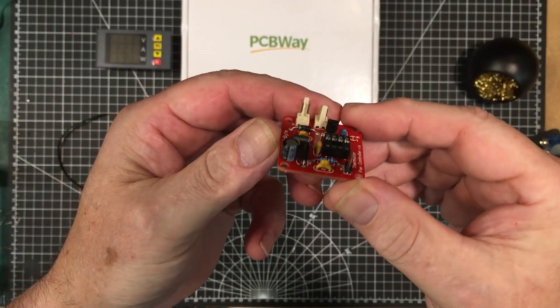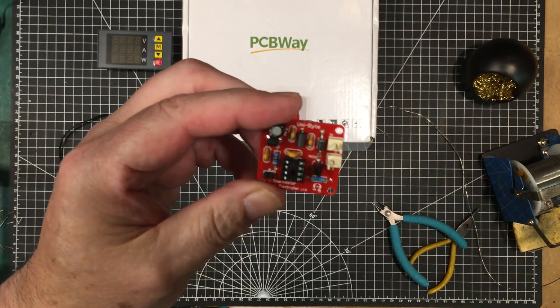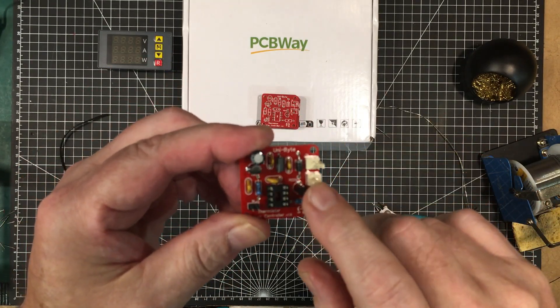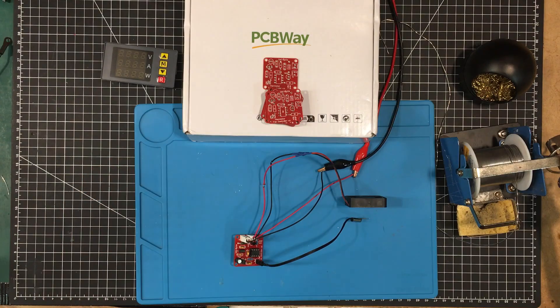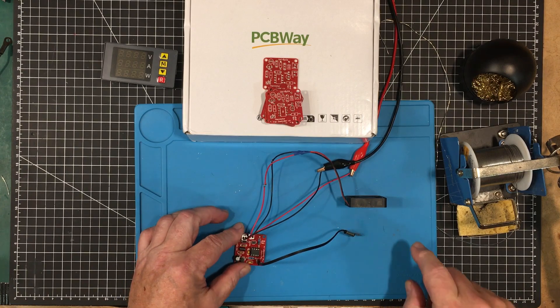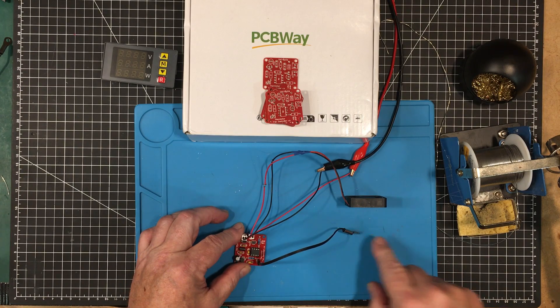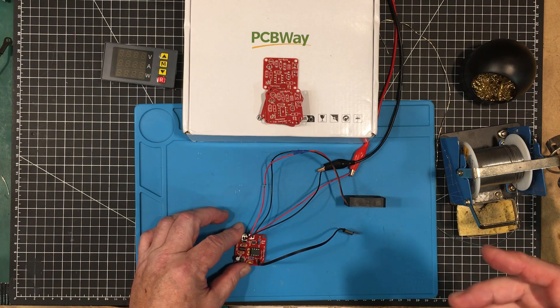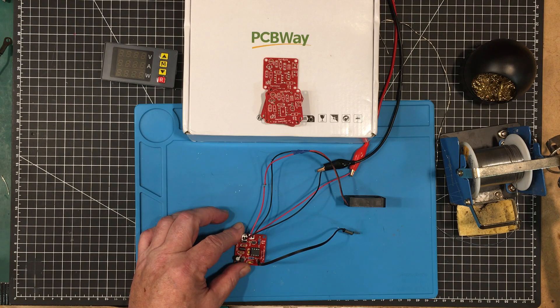The board is all soldered together. Just to test it out — we've got 24 volts, a fan, and a thermistor. Here's the little test setup: I'm going to heat up the thermistor with my soldering iron, with the fan plugged in and listening to it. It should come up to speed very rapidly as the iron will heat it quickly. I'll put the microphone near the fan so we can hear it go through its four different speed steps.